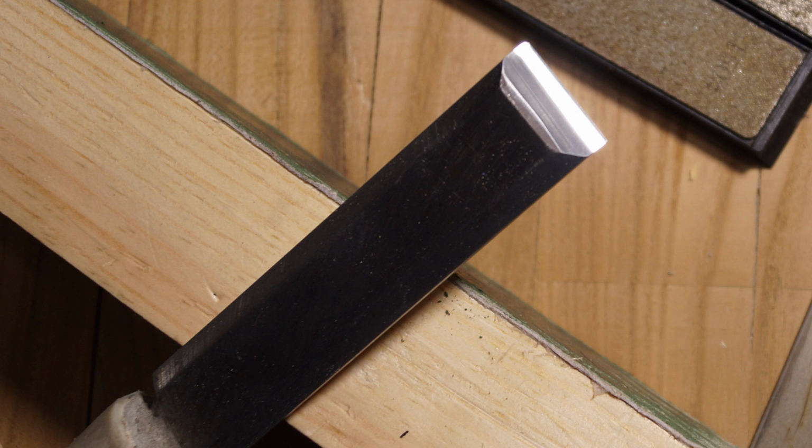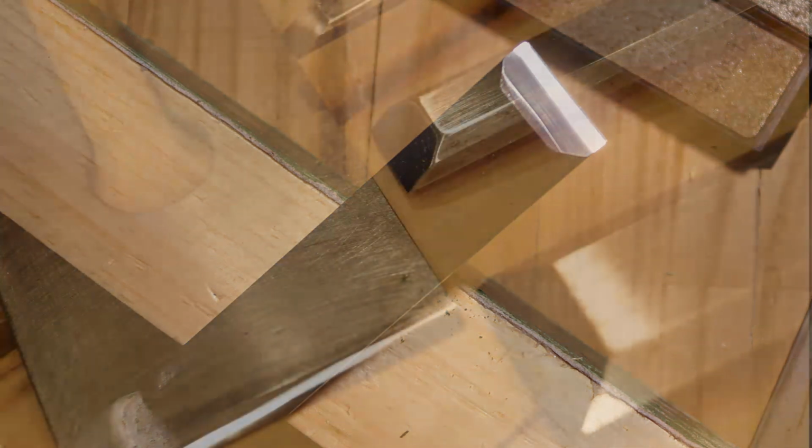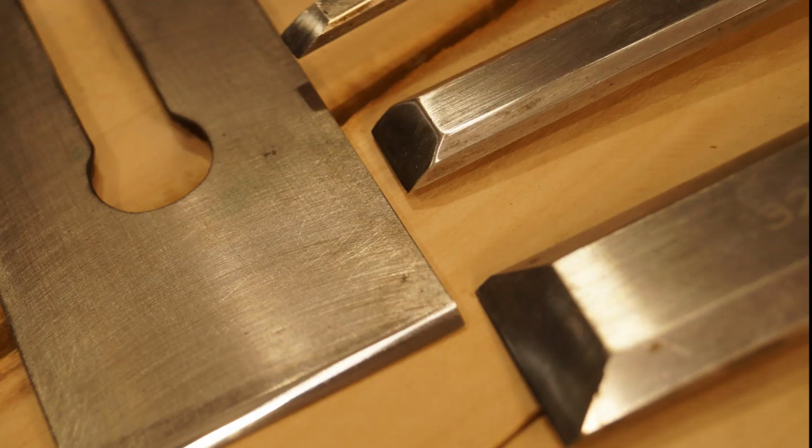The first widely known type is the flat chisel. This is a powerful tool, also called a mortise chisel, used for general work to remove large amounts of waste material. The blade is relatively short and thick, and can be either rectangular or trapezoidal in cross-section, with beveled edges of the blade. You can work with it simply by hand or with a mallet. A chisel with beveled edges is the most useful tool. It can be used as a lever when removing waste.